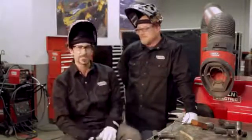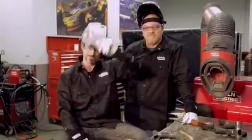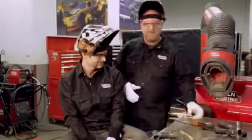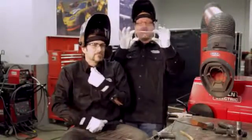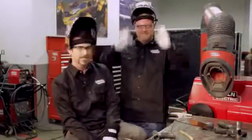Let's start with a little bit of safety. Obviously, you don't want to burn your hands or your eyes. Get your safety glasses on. Make sure you wear your welding hood. TIG welding is what we're going to do today, right about 80 to 100 amps is kind of where we're going to fall. If you're working at a table with a friend, one of the other things we need to protect ourselves from is the rays. Make sure your coat's buttoned up good. Z87 rated safety glasses.